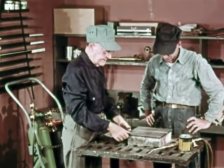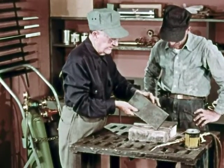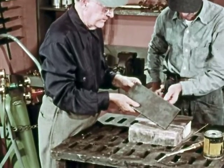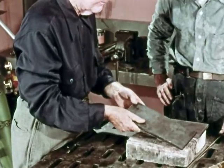Proper tinning is about 90 percent of making a good braze weld. Now you're ready to practice welding heavier metal. Notice that the edges of these pieces have been ground at an angle to form a V. This V gives the bronze a larger surface to hold, and the bronze can get right down to the bottom of the joint.